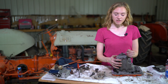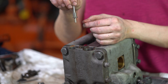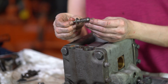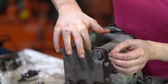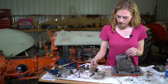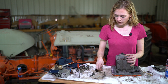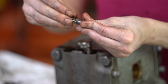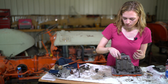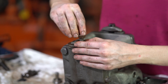I'll show you how to put new valves in your existing chambers if that's the route you want to go. The smallest of the valves goes on the bottom, drops down first. Then the smaller spring, and the medium sized valve goes in as an assembly. Push it down in there as the rod drops in. You can put your finger in to feel it seats properly. Then the bigger spring rests on top, and the cap tightens down. Make sure every part drops all the way down into the assembly before tightening.